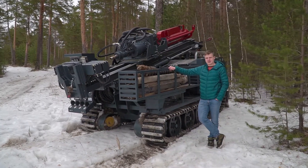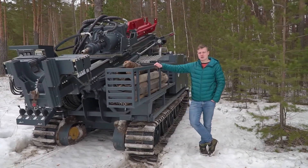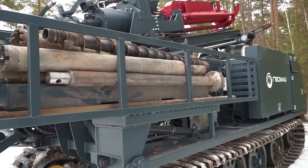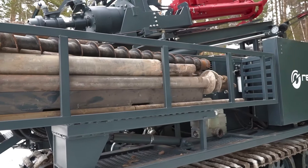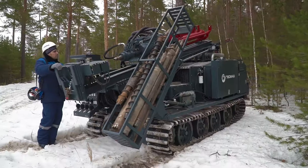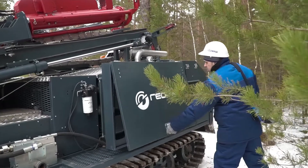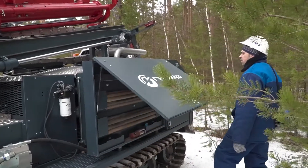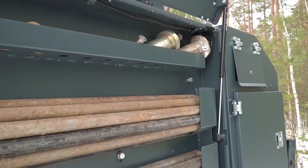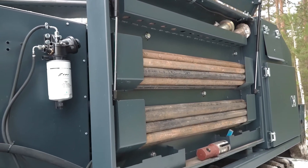On the right side of the drilling rig the tool holder block is located. It is intended to hold drilling augers, drill pipes, and core pipes. Into the shelf for SPT bars and CPT bars you can fit 16 bars of 42 millimeter diameter and 20 bars of 36 millimeter diameter, plus additional adapters and rods.